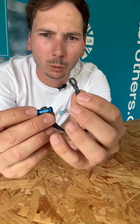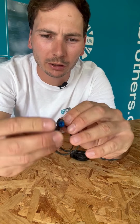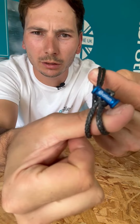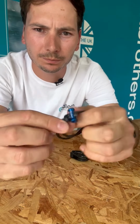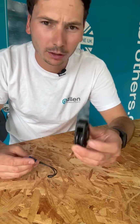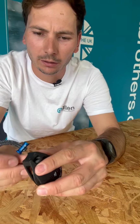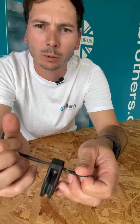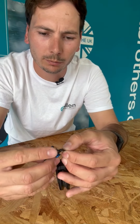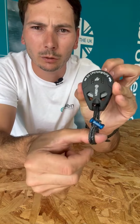Continuous loop with a through splice in one end, and that is simply going to create a nice soft shackle with your Tii-Bone. Really easy. What can you use it for? Well, something like a tie-on block like this one here. Pass it through the head, around whatever you're attaching it to, back onto itself, and hey presto, a nice attachment of your block.